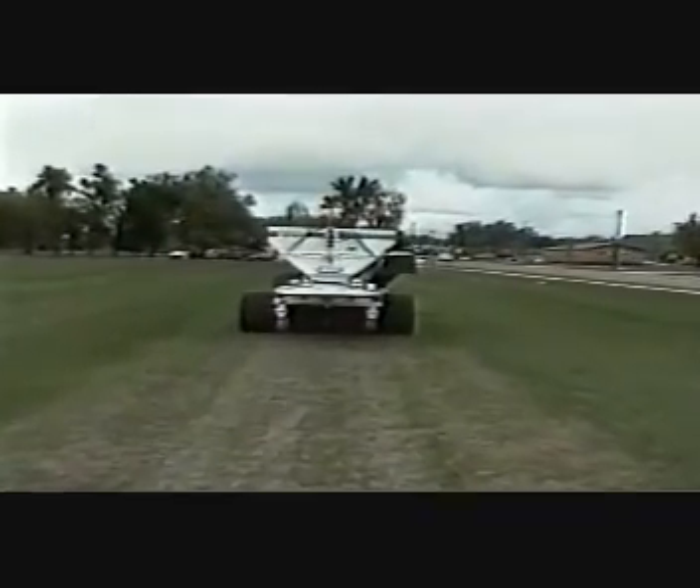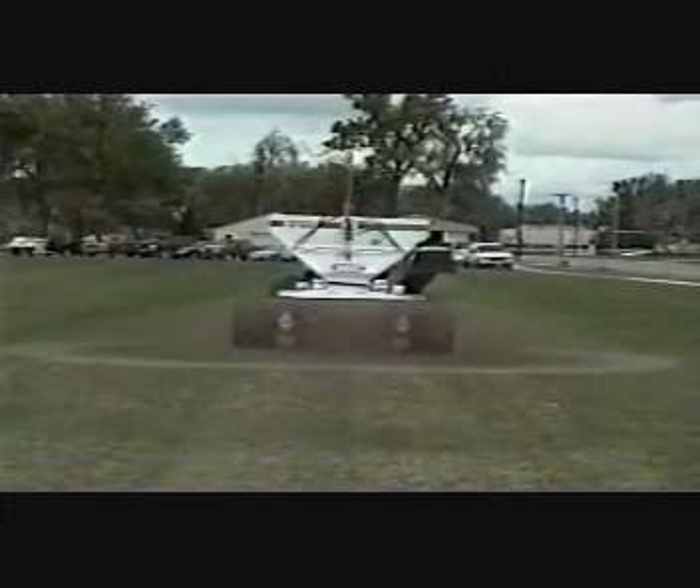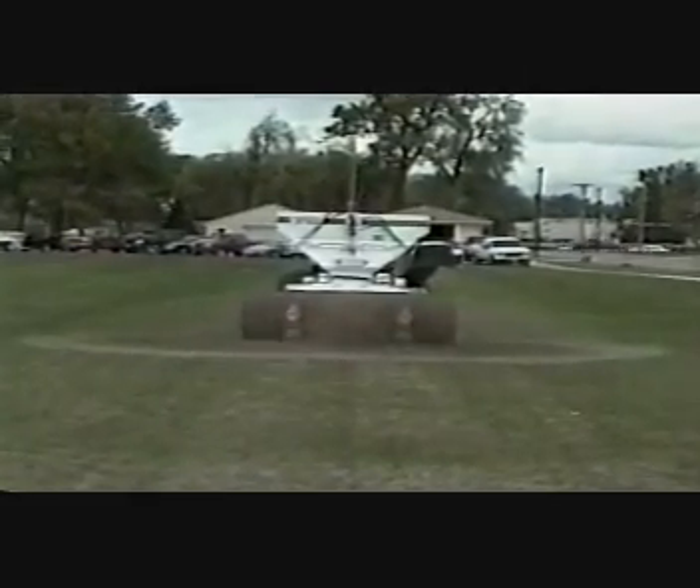Your application rate can be set very accurately using the manual rear door, with a little trial and error with the ground speed of the tractor, belt speed, and spinner speed — because some people want to apply exact amounts of grass seed or fertilizer without having to do all the work.